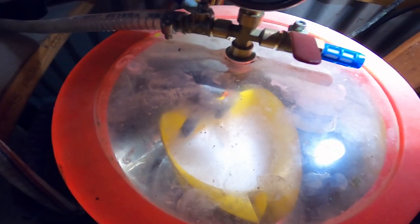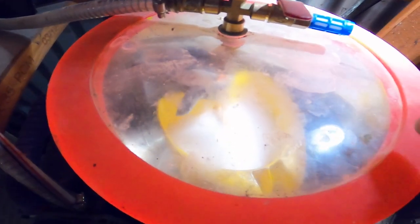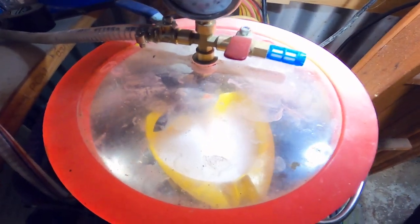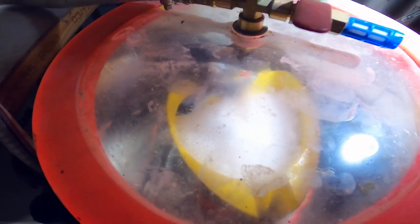And we need to watch this to make sure that the bubbles don't overflow over the container or through the vacuum chamber. So just keep an eye on it. And if it gets to that point, we just release this, let the bubbles drop back down. They won't go back into the timber. Start again, vacuum it up. But we're getting a real good vacuum because it's hardwood. It's not like balsa or pine. It's not going to have tons of air in it. You can see that climbing.